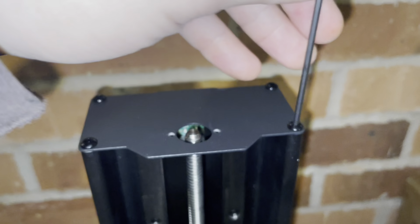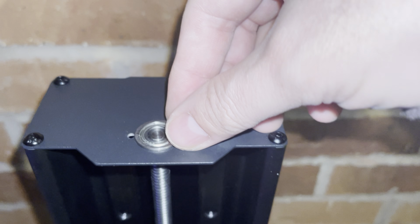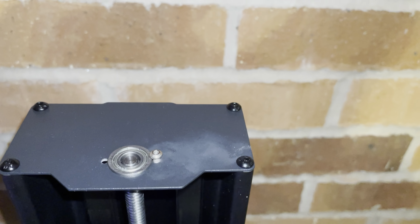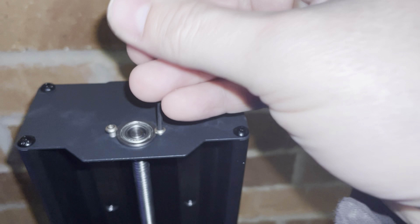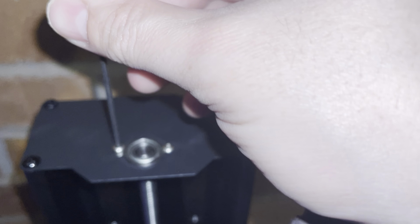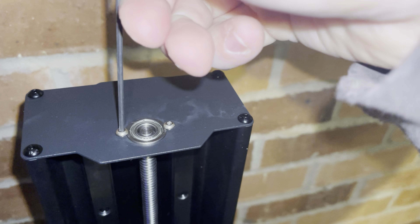Second, you're going to need to place the bearing. There is a right side up, which is the thicker part up, and that should be aligned with your Z-axis. Use the two little silver bolts to secure the bearing in place. These use the 2 millimeter Allen wrench again, and once more don't go too hard on them — otherwise you might strip them, and it's going to be a nightmare to remove if you need to replace any of the components.